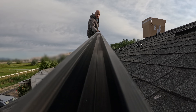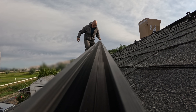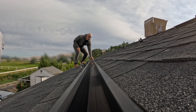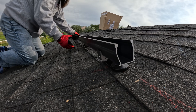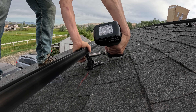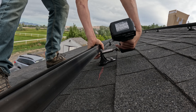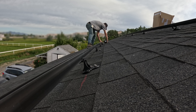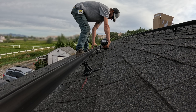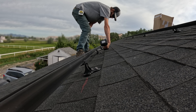You might be wondering: what if I don't live in Utah and I want to try plugging solar panels into my wall outlet? The answer is, without an electrical meter that can read power going in both directions, you'll just get billed for the energy you are producing — your power bill would increase as if you left an electric oven on all day. Obviously, as with any electrical project, check your own local laws and regulations first. I'm just a guy on the internet.